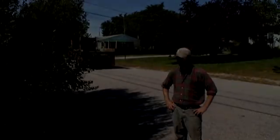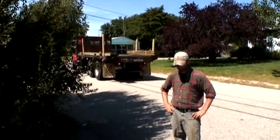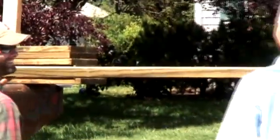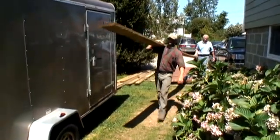To make sure I don't run short of good joists, I usually order about 20% more than I need. I can send the bad ones back to the lumber yard after the job is done and get a refund. Every once in a while, I'll get a load that contains too many unusable joists, which puts a stop to the project until I can get new lumber.